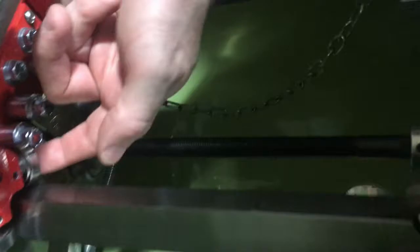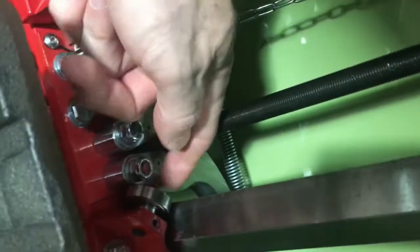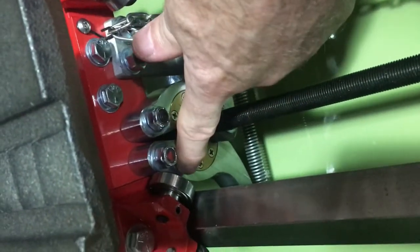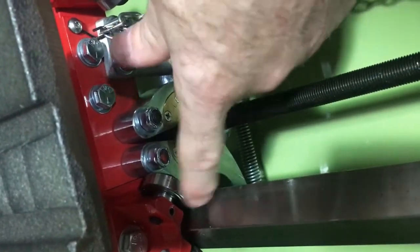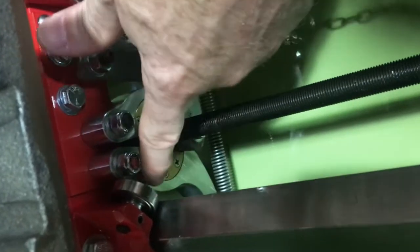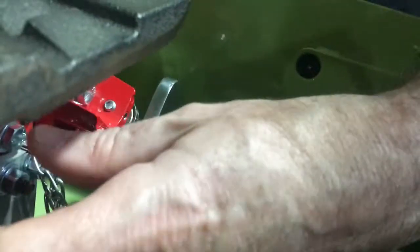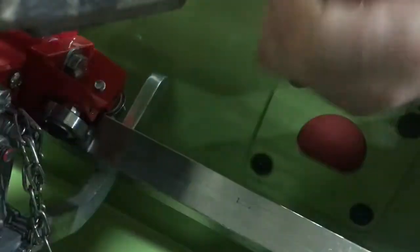Now on the 16, you'll notice that there's one bolt that's special here on the insides, which is a button head. It's because the clearance between the feed dog and this roller bearing is very close, so it needs a round head — we call it the button head bolt. You have to make sure that you put those back in those inside positions so that the feed dogs don't hit the head of the bolt.